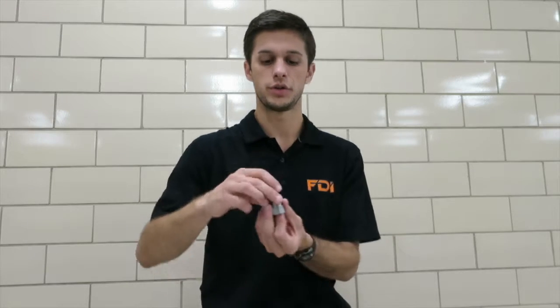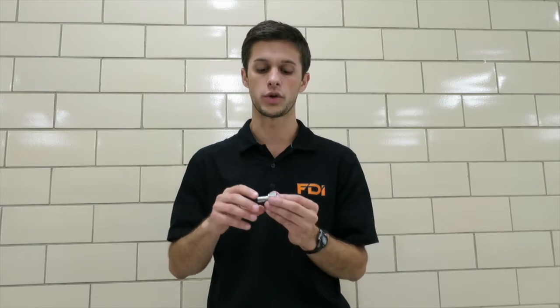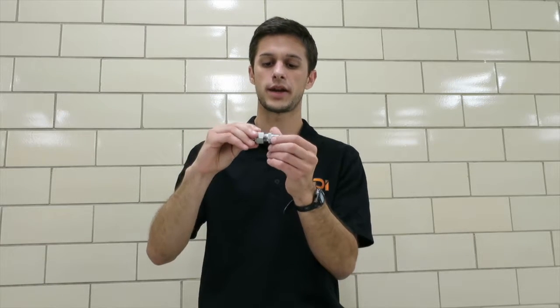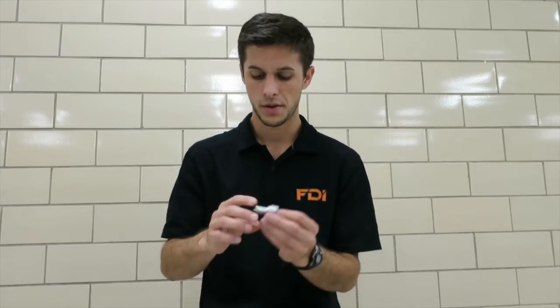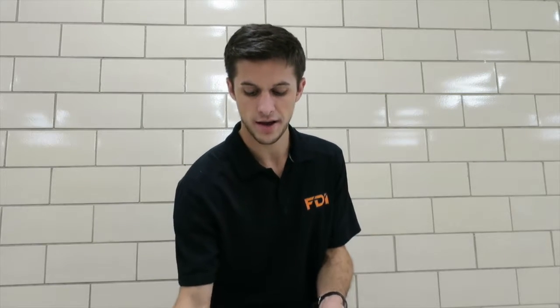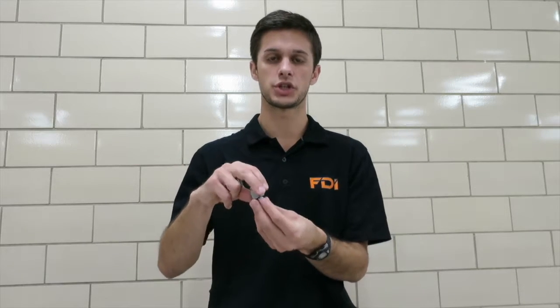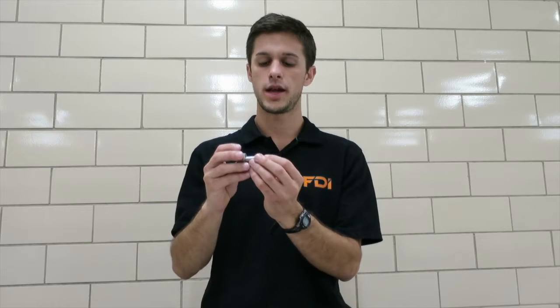So what we're going to do is show you how to pre-swage. Most of the repair parts we send you will already have the Swagelok fittings installed and pre-swaged, so all you have to do is install it and do a quarter turn. But if you were pre-swaging yourself, this right here is called a port connector. It has a machined end — on that end, all you have to do is put an empty nut on it, and it becomes a tube adapter. This is basically a short piece of tubing called a port connector, but you could also have a long piece of tubing.